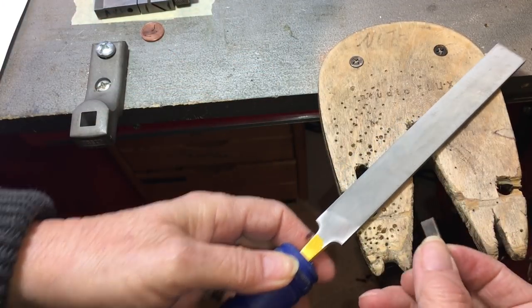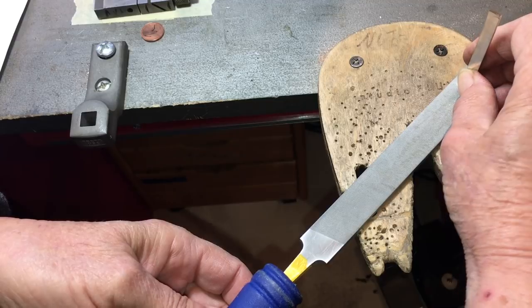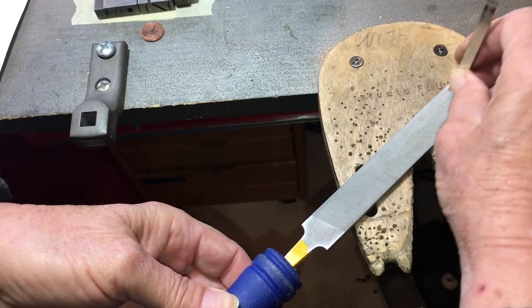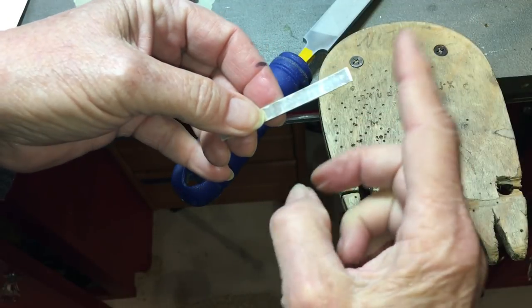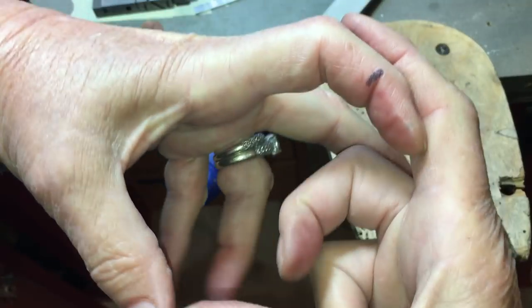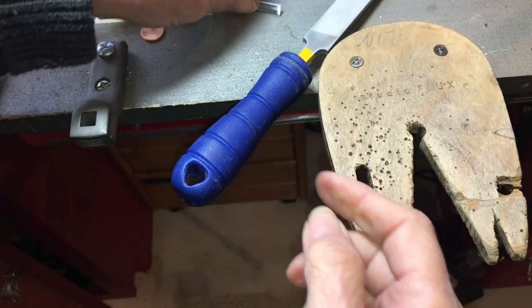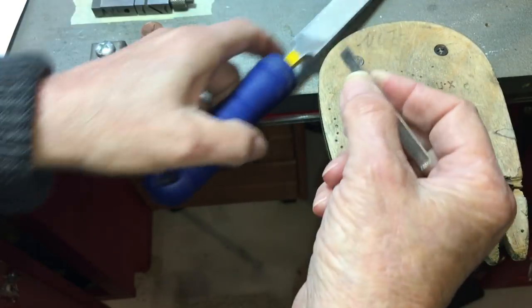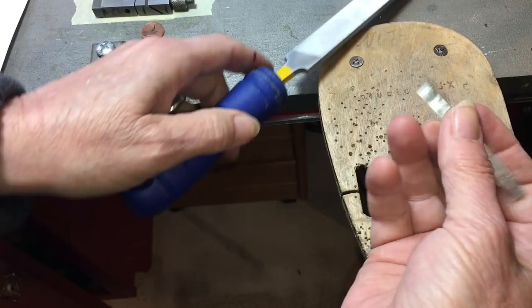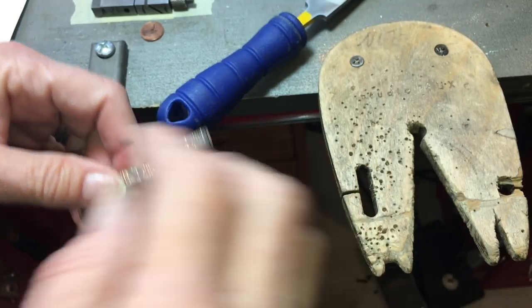Once you have a flat file, try to hold your hand as square as possible and drag down the file face. Another method is to cut extra length on your stock, shape your ring, have the metal cross over, and then cut right through there. Whichever method you use, you're still going to end up with burrs. Do your drag method to take those burrs off before you do anything else. I'm going to put this back to the miter cutting vise to get that done. Then we need to anneal this.